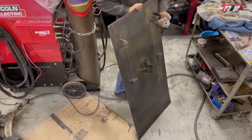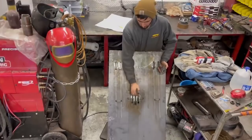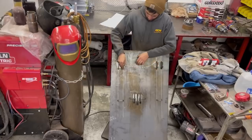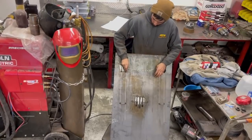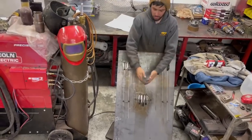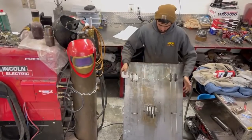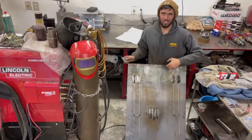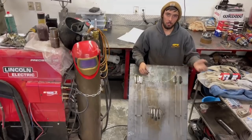As you can see, the plate held my ball joint at exactly the right angle, and held my rod ends on both ends. The tabs and slots locked into the frame to hold everything exactly where it needed to be. Then I had my three starting points and connected the tubes to them. After I had one side done with this setup, I cut the tabs off, flipped the plate over, and welded them in to create an identical mirror opposite for the other side of the car.